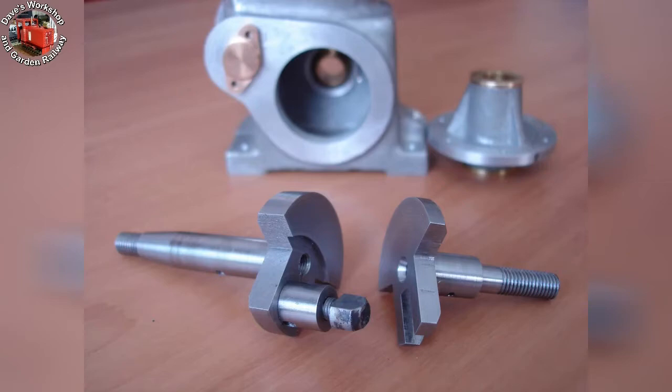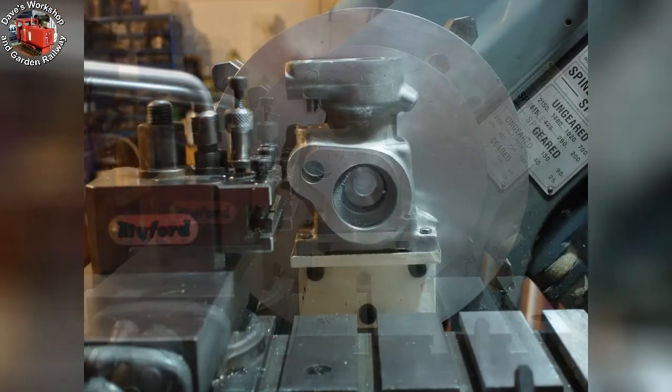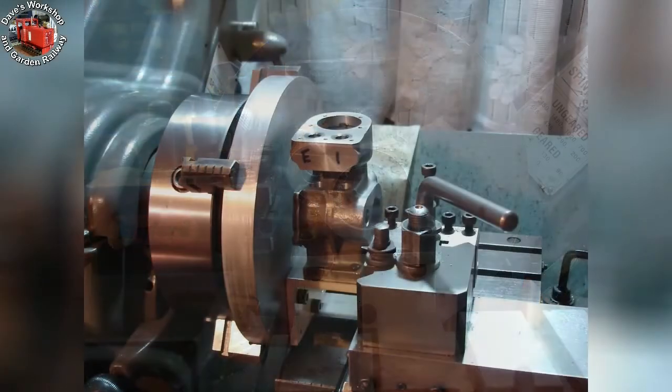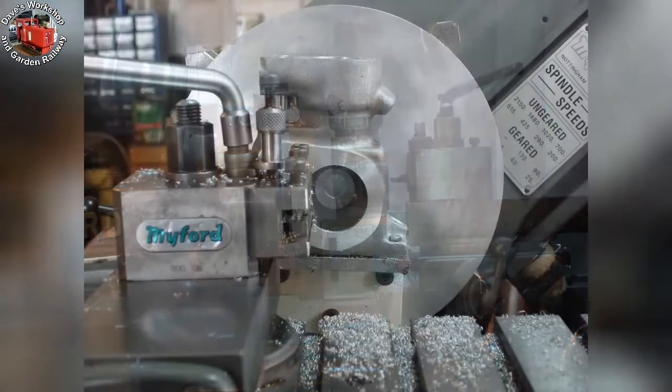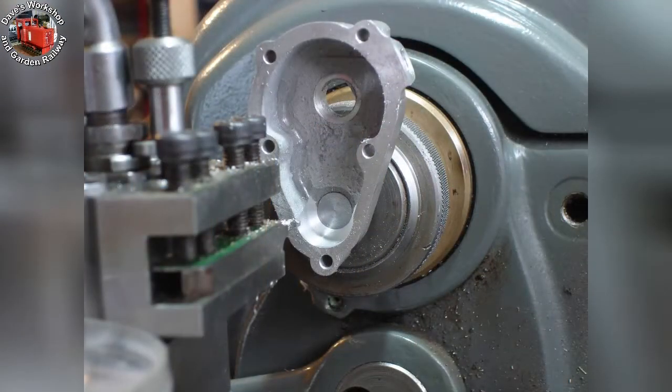Here is the driver stud after hardening — crankshaft, driver stud, and follower. The body casting has been set up again on the original faceplate with the original angle plate for skimming the front face to size. Imagine how this looked on my Emco Uni Mat 3 lathe. The faceplate bolted on to a spindle adapter for the Uni Mat 3 lathe. The timing case needed boring out in places to clear the gears.